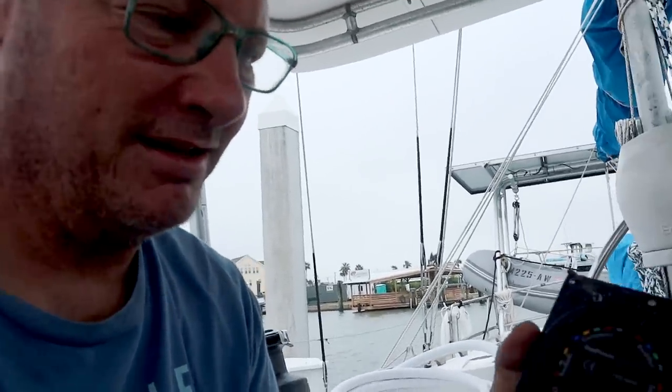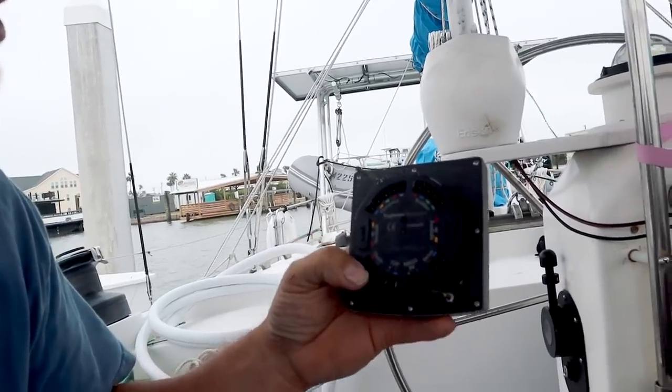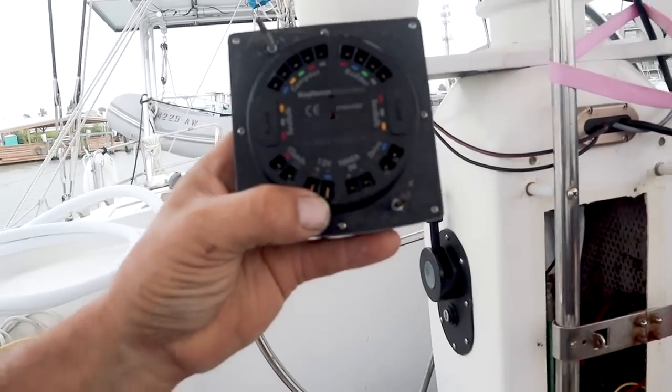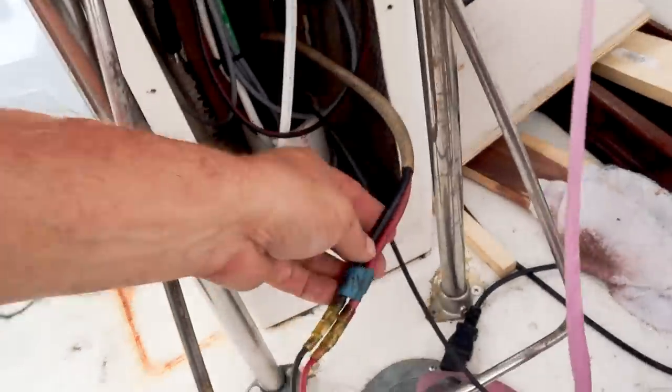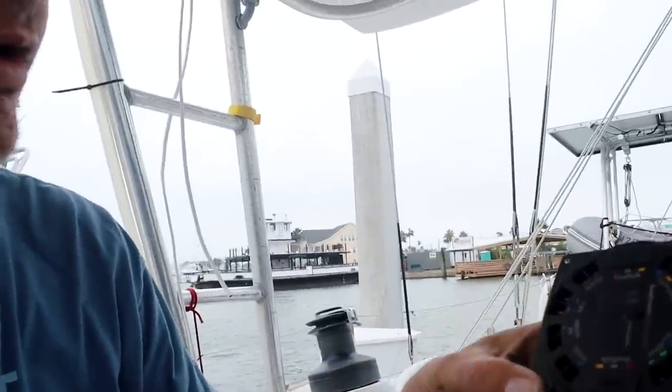I got the autopilot and you can see it's got all these little pins on the back side of it. Most of the pins are pretty small — the only big one says 12-volt, that's power in. The one that says 'drive' is power out, and that one goes all the way to the back of the boat to the hydraulic pump. What they had done was taken 8-gauge wire and spliced it down to probably a 12 or 10, then crimped on these little tiny connectors that fit in this little tiny hole, running maybe 15 to 20 feet to the back.